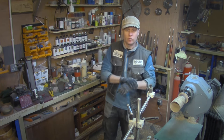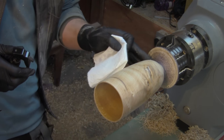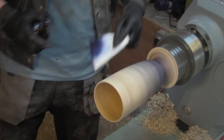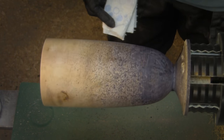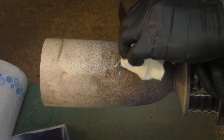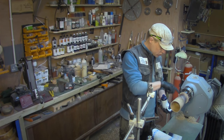Right, now I'm going to stop for a cup of coffee. With coffee done, I've got my midnight blue shade which I want to put down the bottom and feather it up a little bit. I'm going to use the spray cap, just protect the chuck a little bit, and put some of the blue down there. That's come out nice — I like that speckled effect. Then I'm going to use stone blue, and with the lathe stationary I'm going to start rubbing it in down the bottom.